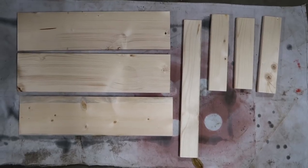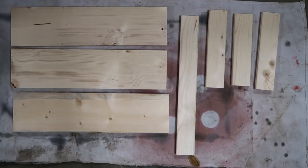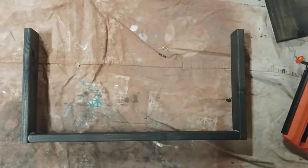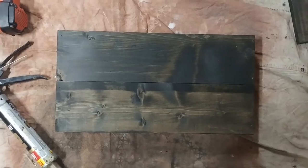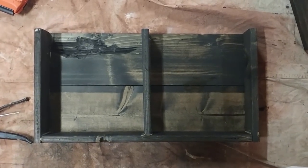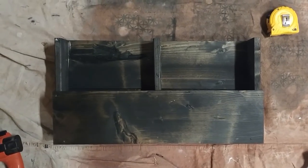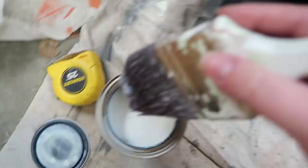Next I made the organizer. I have three 18-inch pieces of one-by-six, one sixteen-and-a-half-inch piece of one-by-three, and three six-inch pieces of one-by-three — I'll leave those measurements in the description box below. Here are just some quick process shots of how I built it. Again, I'm using PL construction glue and nails to put everything together, then I used the same sealant to seal the whole thing.